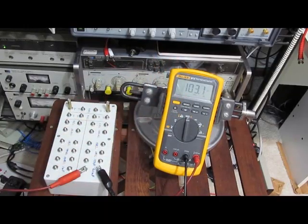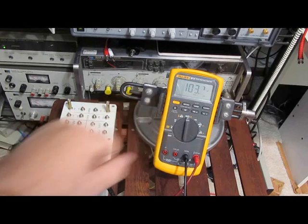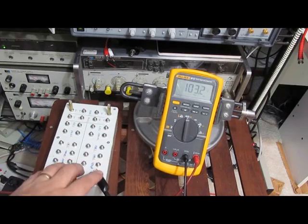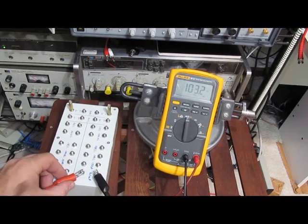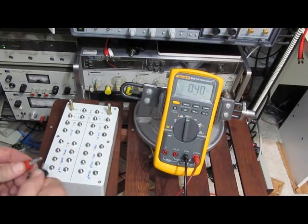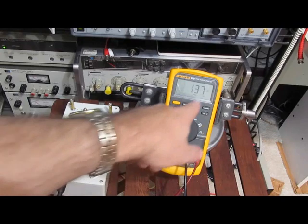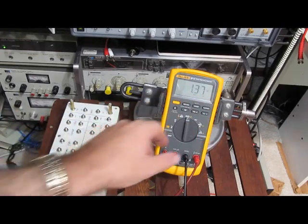So the meter is now disconnected and I've started testing it. It seems fine in AC, DC modes look good. The millivolt range looks good. Diode check looks fine. The capacitance mode right now, you can see it's 103 nanofarad. That's a 100 nanofarad cap. That's pretty normal. So 1 nanofarad cap, the meter's off quite a bit. I saw this before I started even testing it.